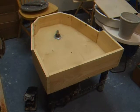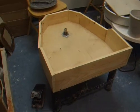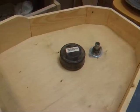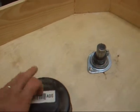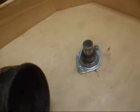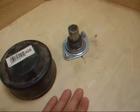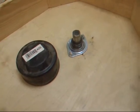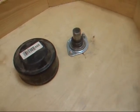So what I did is I decided to make a one-piece wheel box like this, to not use a splash pan. And what I'm going to do here, to protect this bearing, is use this old cap — it's for drainage lines or whatnot. All I'm going to do is drill a hole in the top, then take my router and route a circle the same size as the bottom of this, sink it into the base in the slot I route, and use some silicone sealant to goop it up and stick it in there so it's watertight and protects the shaft from any water, clay, or anything.